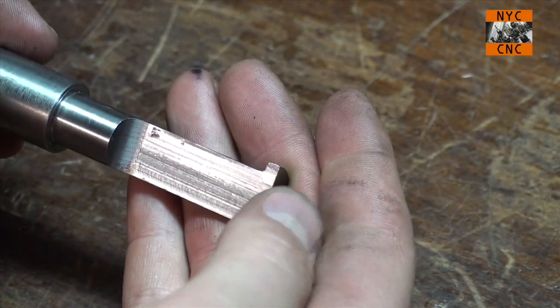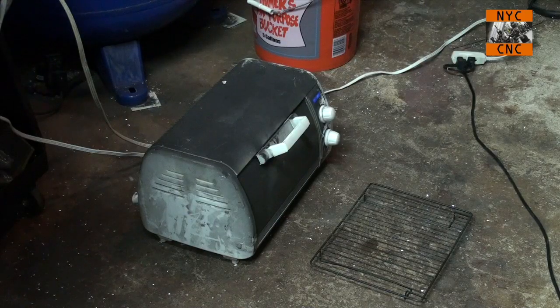Before we heat treat, I've got my toaster turned on and preheated to 350, and I've got the little rack sitting in front of it. Just after we quench the part in the vegetable oil, we will bring it right over, lay it on the tray, and stick the tray in the toaster oven for an hour. But it's important, as I understand it, to have that toaster oven, or whatever you're using to do your temper, ready to go.